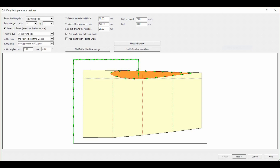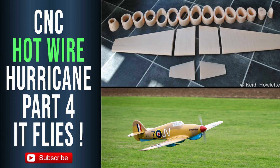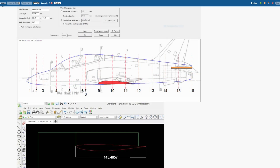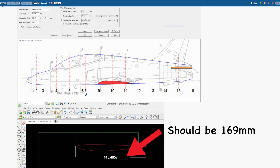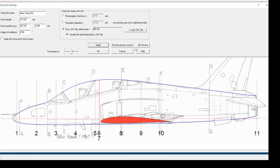This was fairly easy. I was quite looking forward to using the wing slot feature on DevFuzz Foam too, because this is new on version two - version one, which I used on my Hawker Hurricane, didn't have this. Initially it did cut okay, but unfortunately I forgot to press the record button on the camera so I haven't got any footage of it cutting. When it came out it initially looked okay, but when I measured the slot and the wing middle section that needed to go in there, it didn't fit - it was far too small. I checked my settings, puzzled for a bit, and after a lot of investigation it turned out to be a setting in DevFuzz Foam two, so I logged a ticket on the DevCad forum.